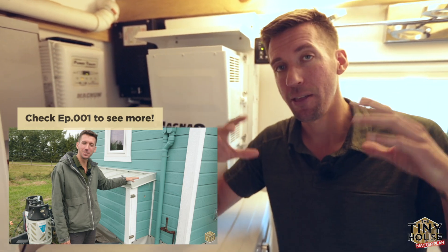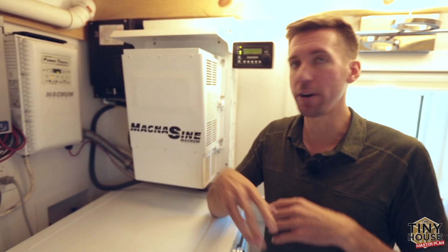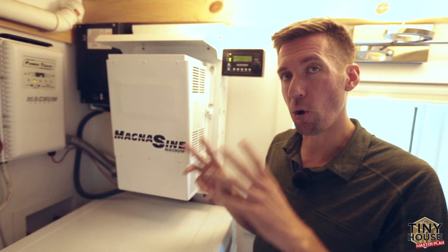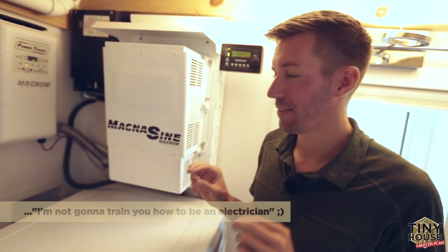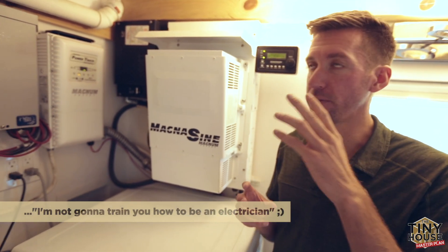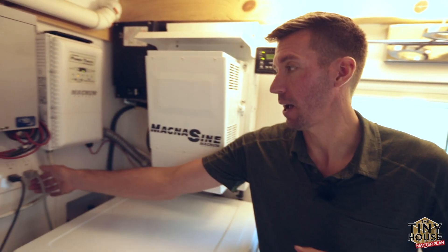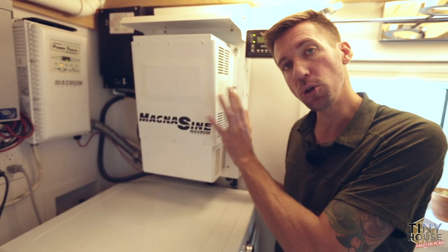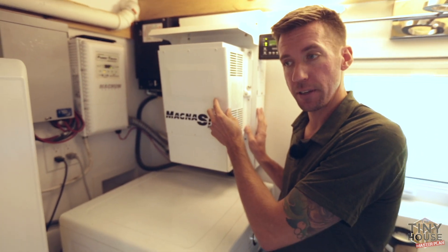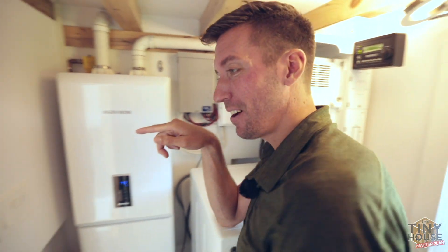Power leaves via this cable with metal wrapping and goes into my battery box on the tongue of the trailer, where it sits until it's asked for. Coming out of there it's DC power, and I'm running everything on AC. The batteries hold power in DC format — direct current. To change it into AC, which is what most of our outlets and appliances want, like my washing machine, this is an inverter — it inverts that DC to AC.